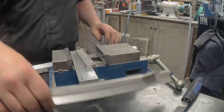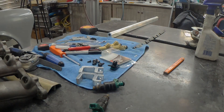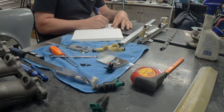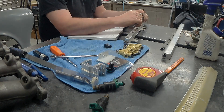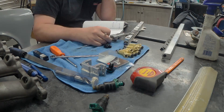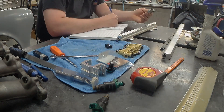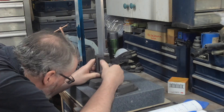The first step in making a fuel rail is to get all the measurements right. There's enough movement in a fuel injector that you can probably be a little bit sloppy, but I'm retentive enough that that's not going to happen. So we're taking all the measurements from one end of the fuel rail. Are the spacings all the same? Yeah, they're the same. I'm setting this all up so I can go over to my surface plate with my height gauge and lay this all out in one go. I've got it parallel, I've got some 2-4-6 blocks — big machinist blocks. I've blued the whole thing.